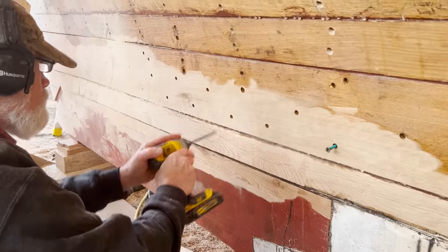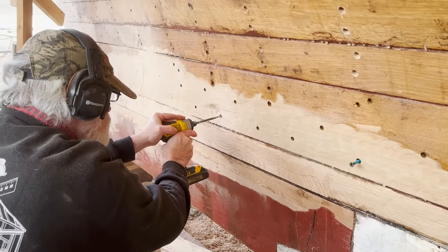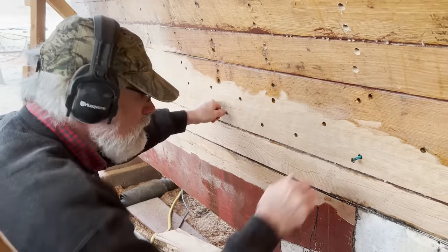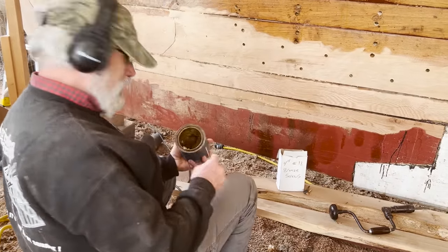Over on the starboard side, the screws along the rabbet weren't set deep enough. Steve, on his first plank, wasn't sure how much backing out would be needed, so these needed to be bored out a bit more and get fresh fasteners. Get your toilet bowl wax? Yeah.